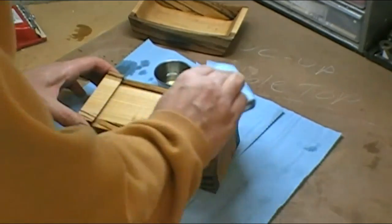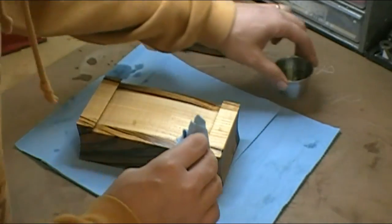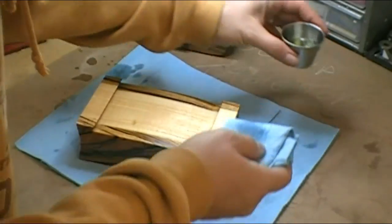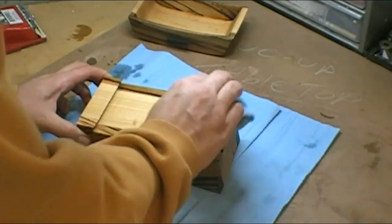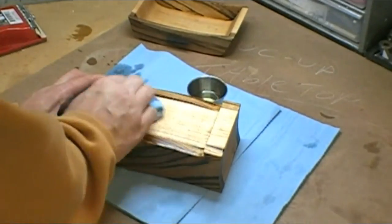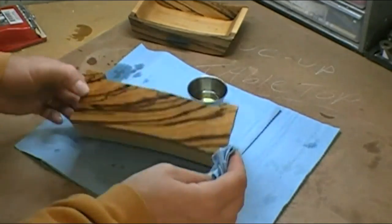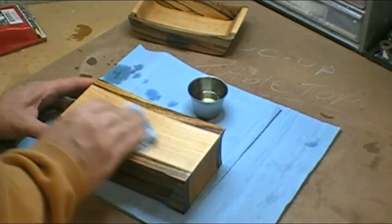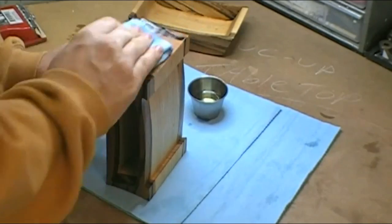All right. Put that there. All right, let's get some more oil. This needs to be pretty heavily oiled here, the first coat. I want it to really get into those. It's not going to get too far into the pores because we used that pore filler, but I really want to get the first coat on there pretty decent without being sloppy. I want it to work itself as much into the wood as possible, even though the pore filler is there, and then the lighter coats.